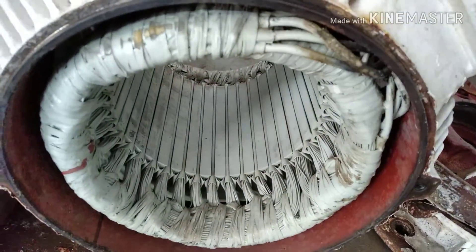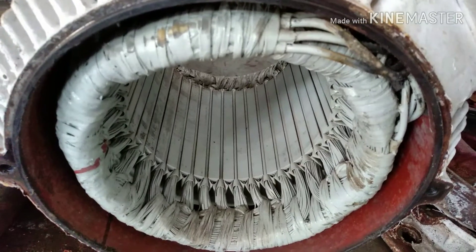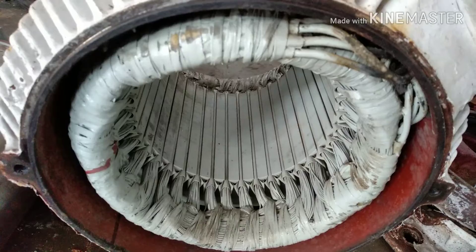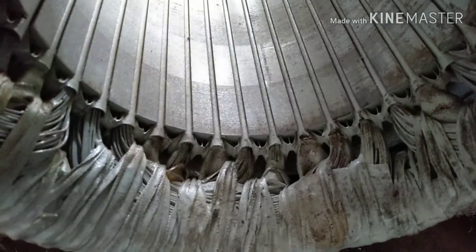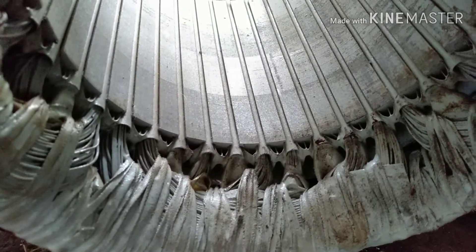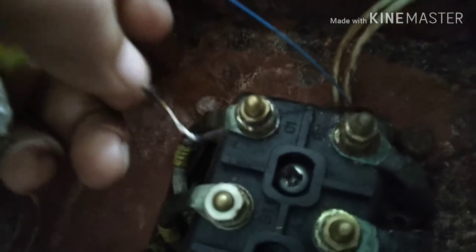Let's consider this example on your screen — you can see an AC motor. The winding is healthy, there is no problem with the winding. But the only problem in this case was that the thermistors inside the windings were faulty. This motor was used in a highly sensitive area where thermistors are mandatory before operation, so we had to replace them. Since thermistors are placed deep inside the winding, we had to rewind the complete motor to allow us to replace the thermistors.